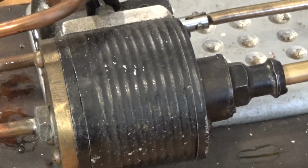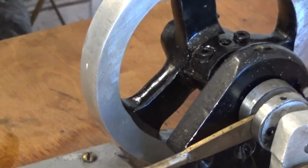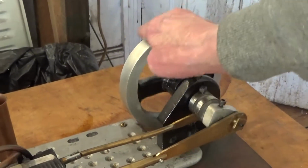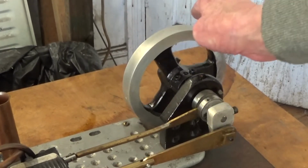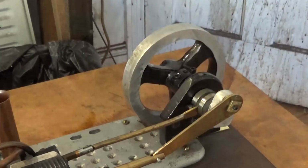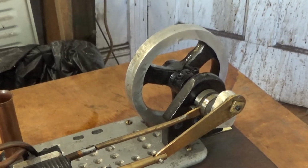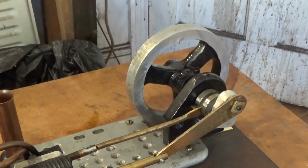And the flywheel itself, because it's very low grade aluminium, it's got hard and soft spots in, and I wanted my flywheel to run true, which if I just move that out a bit and show you, you probably can or can't see, I don't know, but it does. It's not absolutely true, but I got it within 2 or 3 thou, and 2 thou is the width of a hair, so it's just about true, because all the little models I saw have flywheels and they wobble about like that.